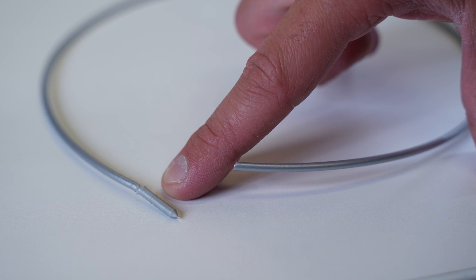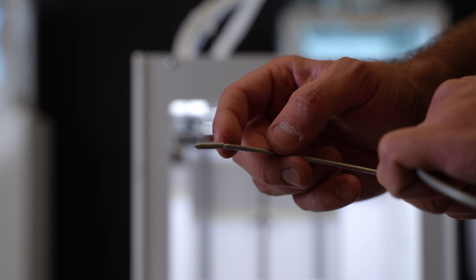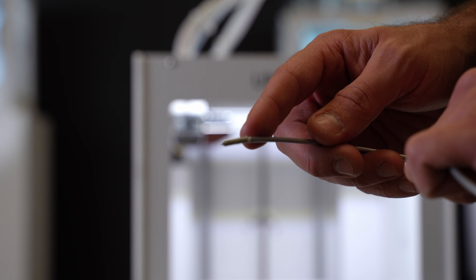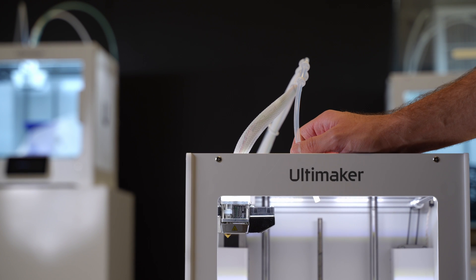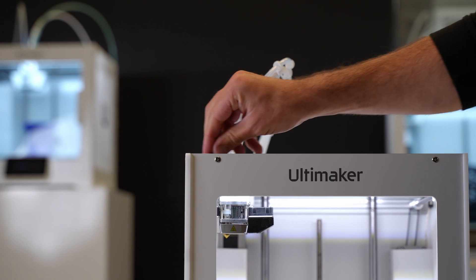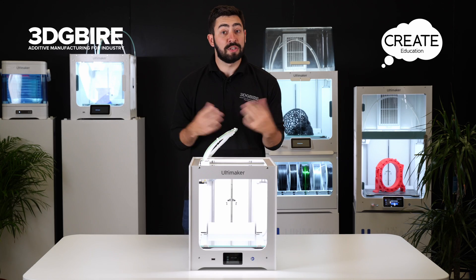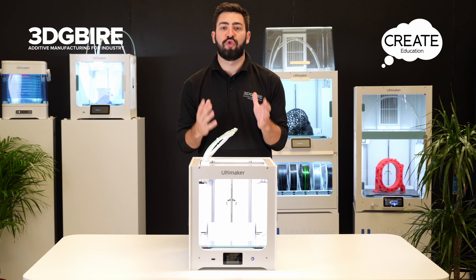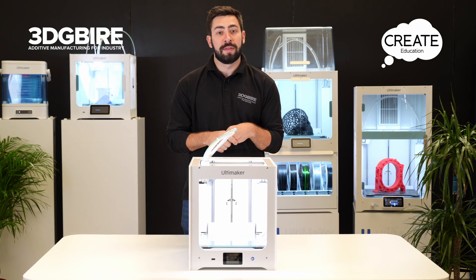We now have the cold pull with a nice shape of the inside of the nozzle. We don't want this to be elongated or snapped off — as long as there are no other colors involved, that means we're ready to print and reload the material. Set the temperature back down to zero, reinsert the tube into the top, reinstall the collet clip, and that's the hot and cold pull complete. Do the hot pull first, then the cold pull second, and if we get that nice clean crisp tip, the nozzle is as clean as it can possibly be — giving confidence in the next print.